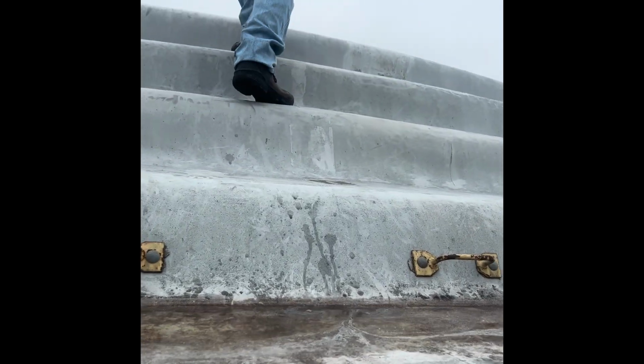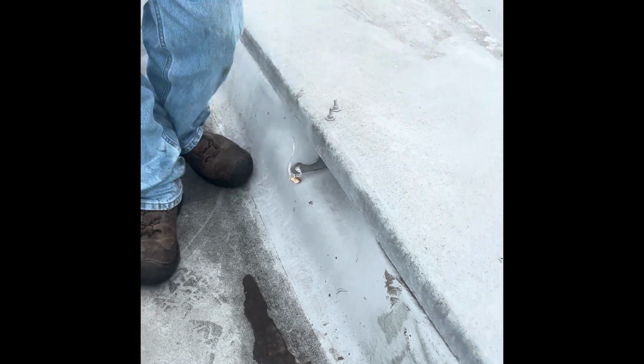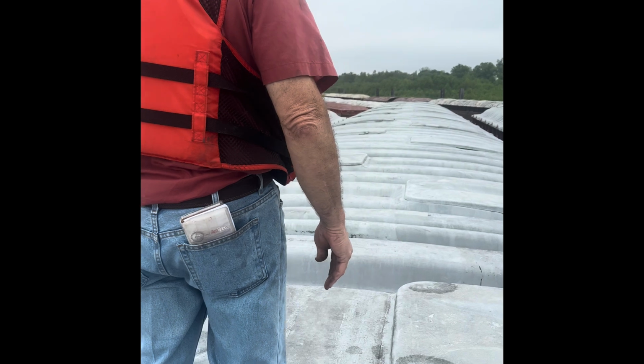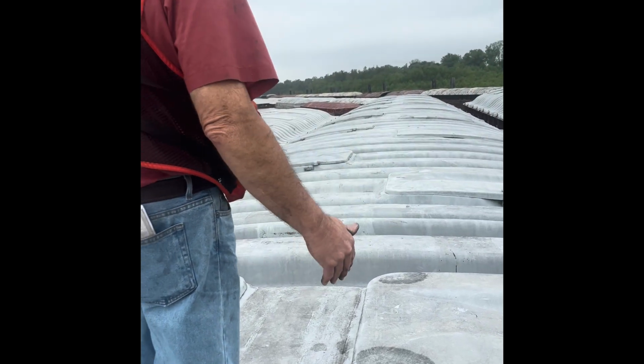We're checking the top for residue from previous cargo, standing water, any kind of contamination that could contaminate the customer's cargo. And as we're right here, we're also checking the latch and the keeper. Make sure that this latch does in fact engage the keeper. Down one side and back up the other side. We're going to go our starboard side first. That's the way we drafted the barge.